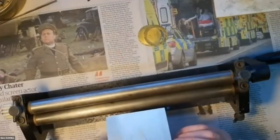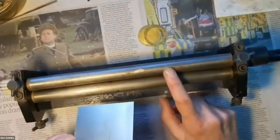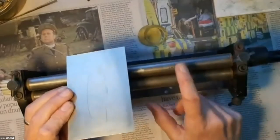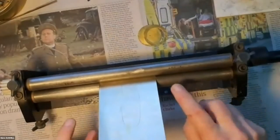The first thing to do - and this isn't a definitive way, it's just how I do it - is the problem with pinch rollers: when you get towards the end of the rolling session, the end piece flips out of the pinch rollers, so it won't form the last section. To solve this, you form that part first by putting the material through the form rollers backwards. The material should go in through the pinch rollers normally, but to get an initial curve on the end, I push it through backwards.